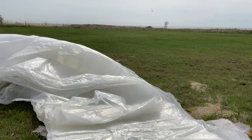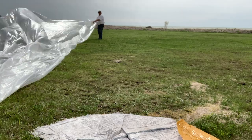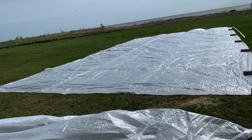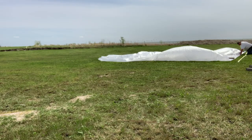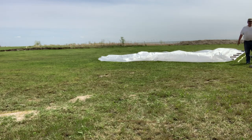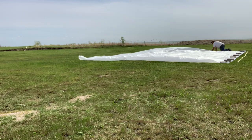The first thing I did was stretch out the plastic. You got to know what you're dealing with before you can deal with something. I had a lot of space. The problem was there was a lot of wind that day, so it was kind of difficult working by myself as the plastic acts as a sail. Next, I doubled up the plastic. Once again, I had to fight with the wind. But when you install the plastic doubled up, it makes it so much easier to install it into the furring strips, have everything tight, and put the air blower on it.